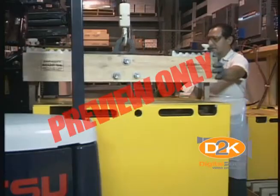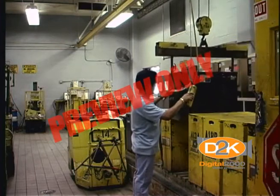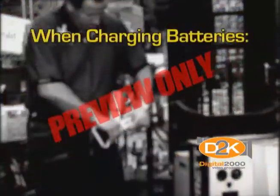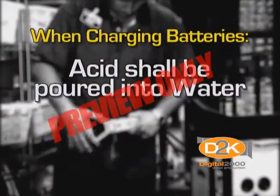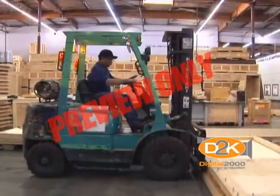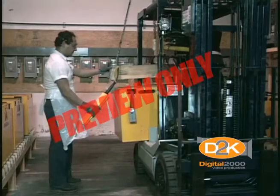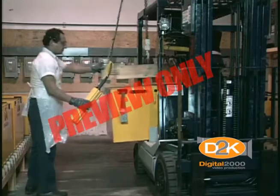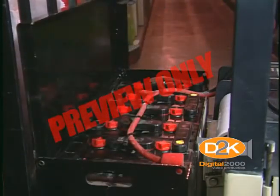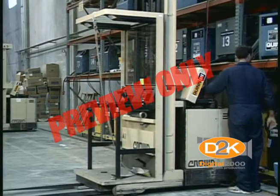When handling large batteries, a conveyor, overhead hoist, or equivalent material handling equipment shall be provided. When charging batteries, acid shall be poured into water, but water shall not be poured into acid. Trucks shall be properly positioned and brakes applied before attempting to change or charge batteries. Care shall be taken to assure that vent caps are functioning. The battery compartment shall be open to dissipate heat during charging.